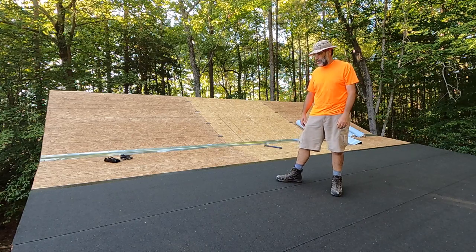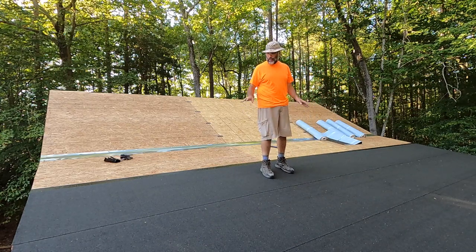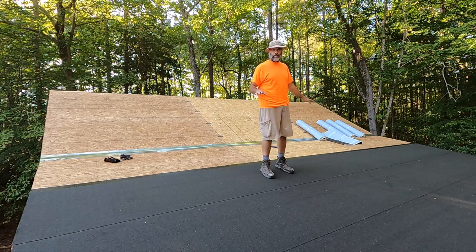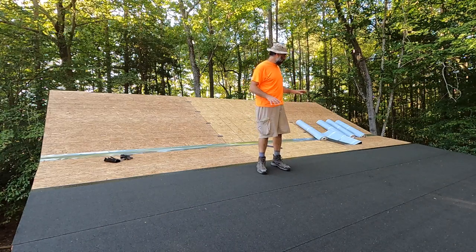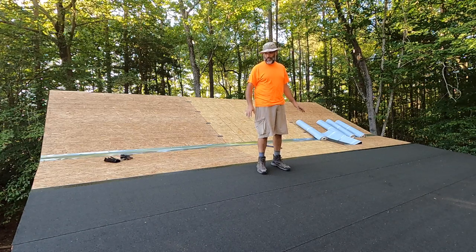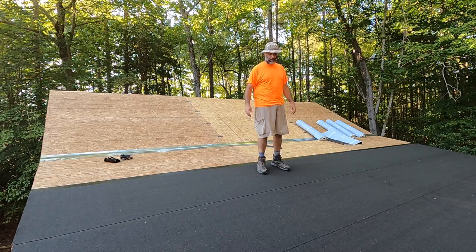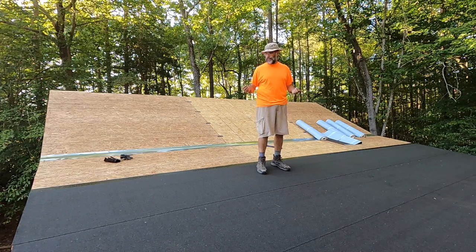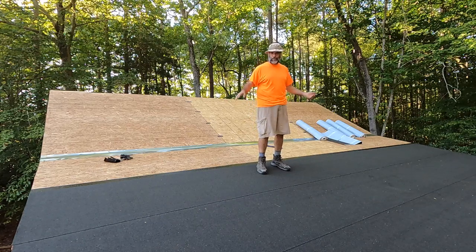That's how I do a full row of this stuff without breaking it into small pieces. Pin it with a nail in the middle as a reference, keep adjusting — I probably adjusted this four or five times before peeling any adhesive or committing to anything. Then pin it, stretch it to both ends, and start peeling carefully, pulling the backing paper from underneath. Don't ever roll this stuff over or flop it over. Just leave it laying flat. It's an interesting material — strong with some stiffness to it, but also a little limp, so it will lay flat very readily.